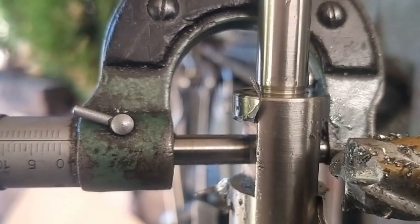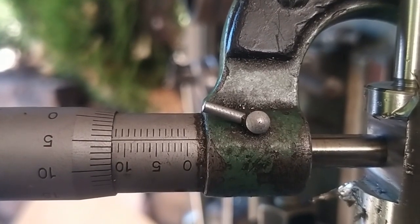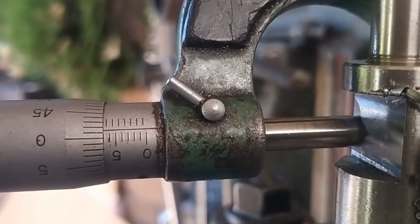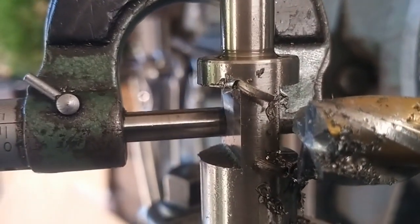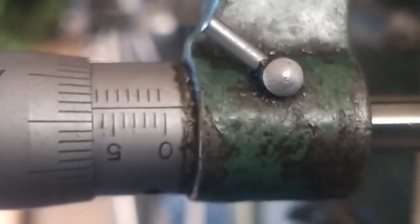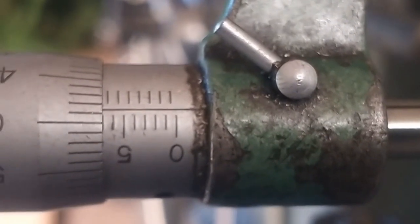That's where we landed. I'll come back when I've got it down to 7.0. Near enough. 7 or 6.99. We're at half a mil clearance anyway on our 110 mil postie bike drum brakes, so that's achieved by a spread of 8 mil and this is 7 mil, so it's half a mil per side.